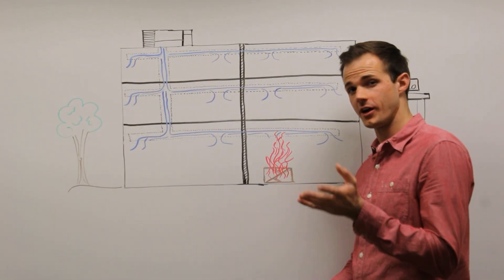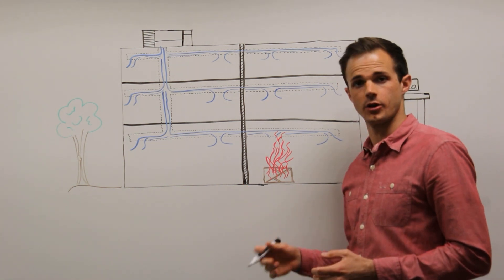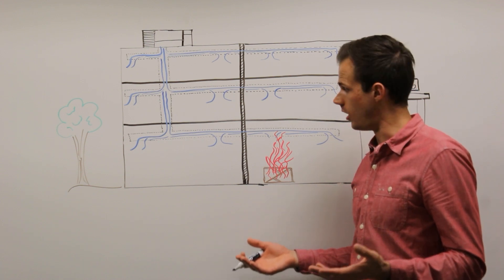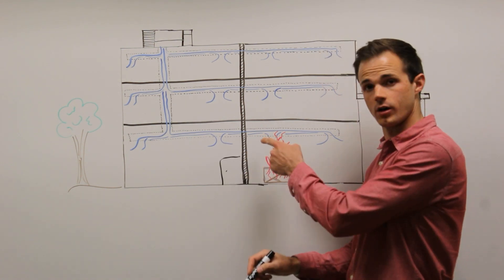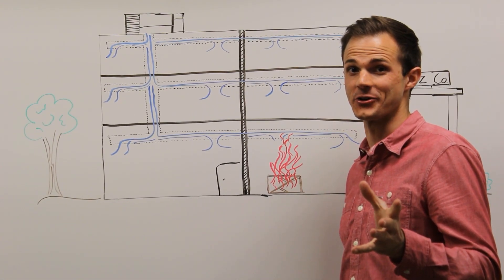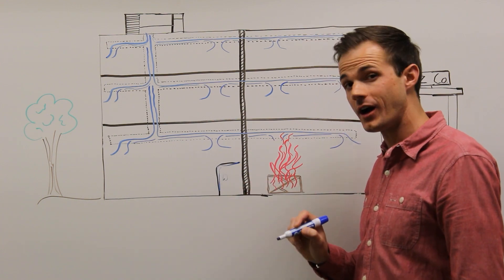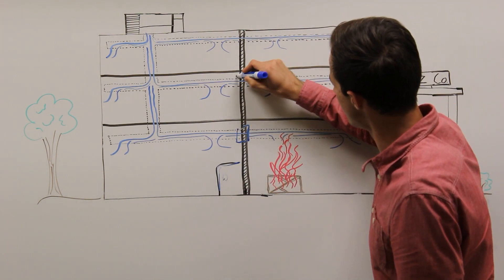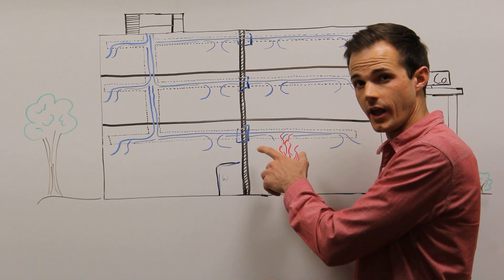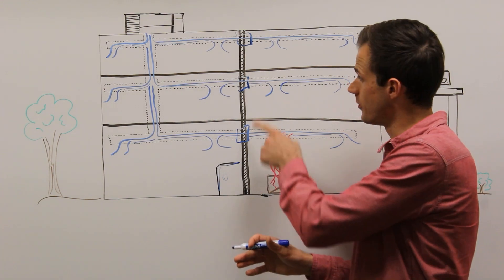But to understand what a fire damper is, we need to understand what a firewall is. A firewall is a part of a building that's used to either prevent or slow the spread of fire. The keen observer may ask: why bother building a firewall when doors or duct work would allow the fire to pass through? Not so fast, says the National Fire Protection Association. There are requirements for the design of fire doors and fire dampers to prevent the spread of fire throughout the system. And that's the key to where fire dampers are located — at these critical points between the building's HVAC system and firewalls to prevent the spread of fire.